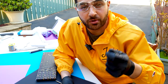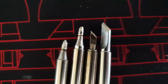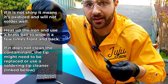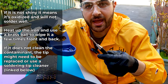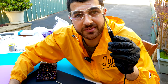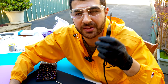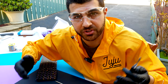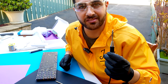Before you start soldering, check your soldering iron tip. It should be nice and shiny. If it's not, get a brass ball — do not use stainless steel — and clean the tip until it's shiny. If it won't go shiny, it means it's very oxidized and you might need a new tip. A bad tip will make soldering your mechanical keyboard very difficult. Once you've confirmed you have a good tip and a good iron, you can start to solder.